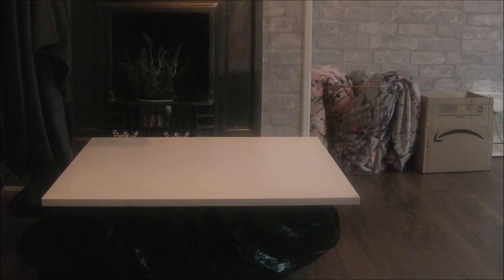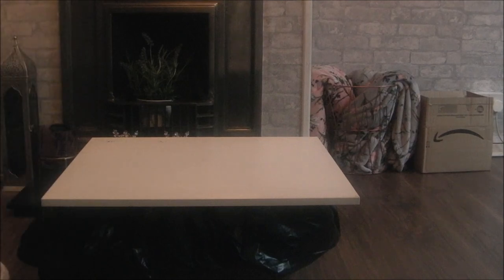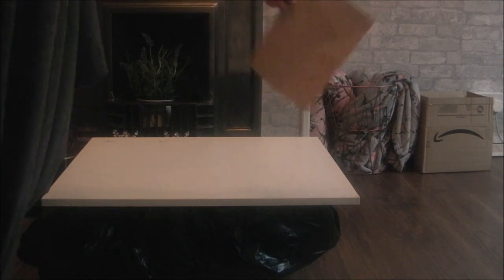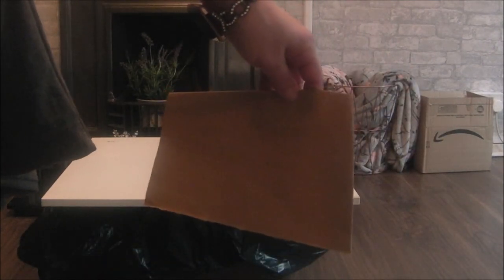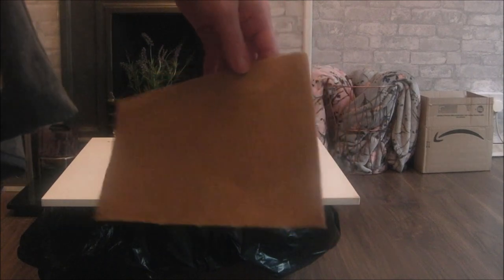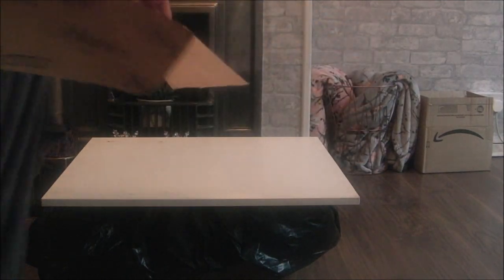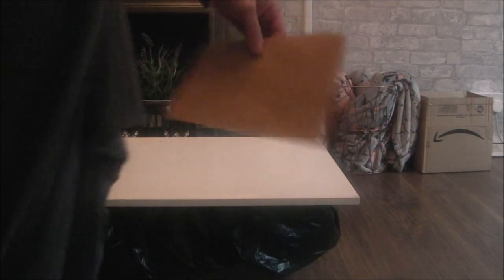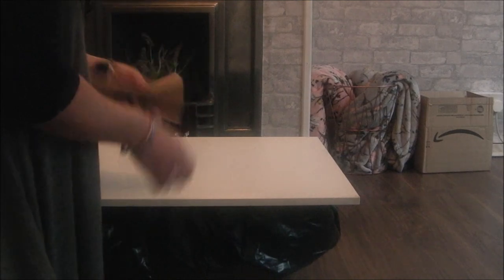So as you can see, I've just put the kitchen unit on top of a little stand here, and I'm going to be taking my sandpaper, and I'm just going to lightly sand the top surface, just so that the paint that I'm using is going to definitely latch onto this cupboard here. Okay, so that's what I'm going to be doing. So this is just the prepping now for paint work. So we're going to just lightly sand the unit.